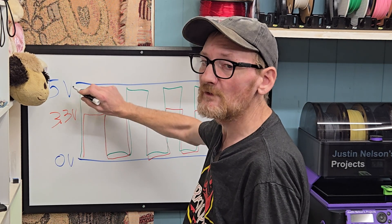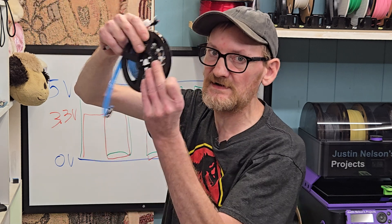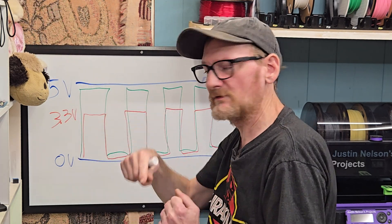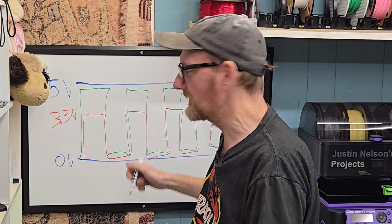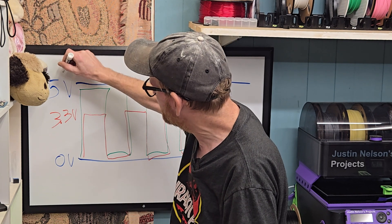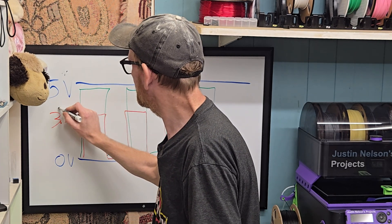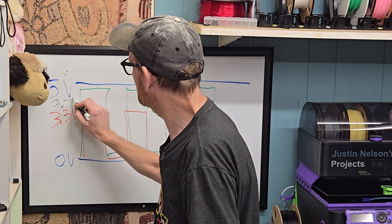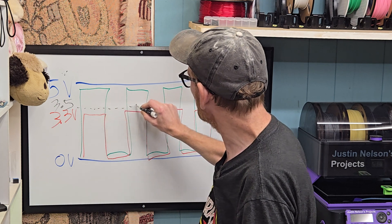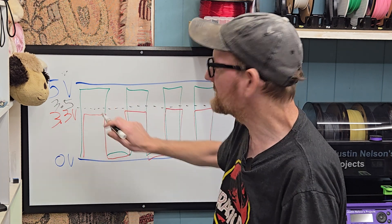In a moment you'll see why that's important. The threshold on five volt logic — specifically in the case of these RGB LED strips — the threshold between flipping from a zero to a one in binary is 0.7, or 70% of that five volts. What is 70% of five volts? 3.5 volts — which means our threshold is right about there. The Pi isn't quite hitting that threshold to reliably flip that zero into a one every time.